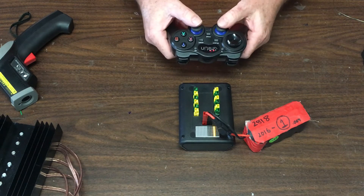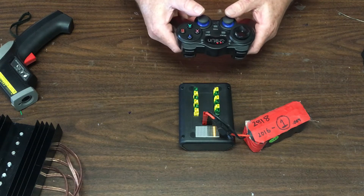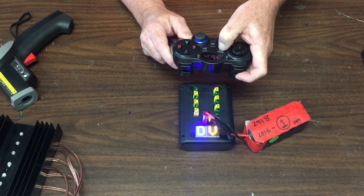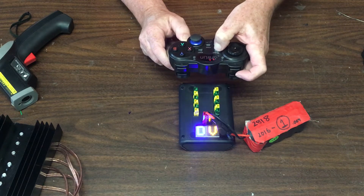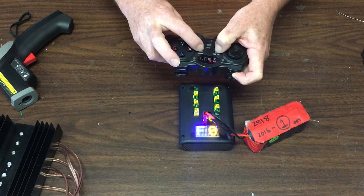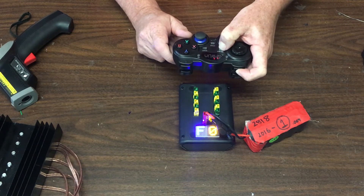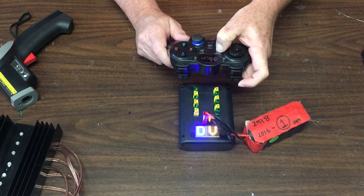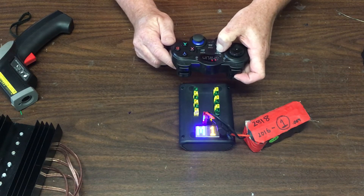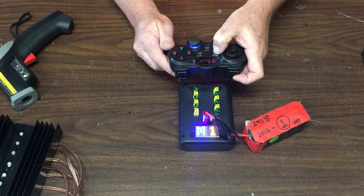To change the flight modes — which you'll only need to do based on your pilot preference or specific ROV — hold the Select button to enter the configuration display. The left bumper lets me change flight mode; hitting it now shows F0, meaning flight mode 0. Flight modes and motor configurations are stored in flash memory on the unit, so once you've set it up it remembers, and next time it powers up it comes up the same way. Hitting the bottom button shows the motor configuration — right now it's motor configuration 1, which is a basic non-vectored thrust: two axials, two laterals, and two verticals.